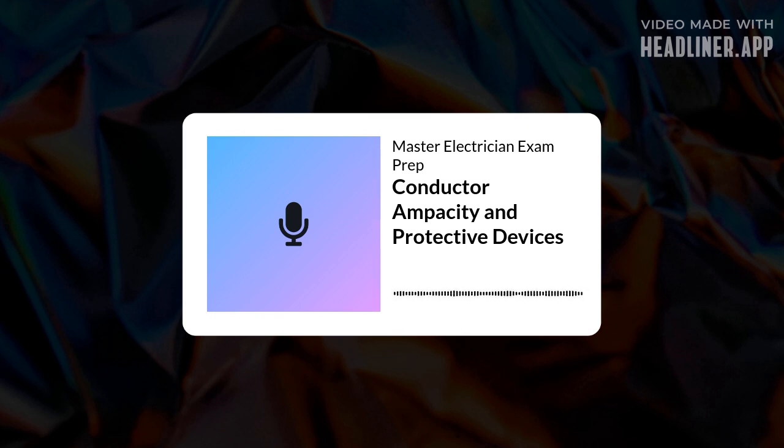Okay, let's quickly revisit sizing OCPDs for continuous and non-continuous loads with those examples. 23 amp load. Okay, 23 amps. Is it continuous? Let's assume it is for calculation. 23A by 1.25 equals 28.75A. You need an OCPD rated at least 28.75A. The next standard size up from 28.75A is 30A, so a 30A breaker.